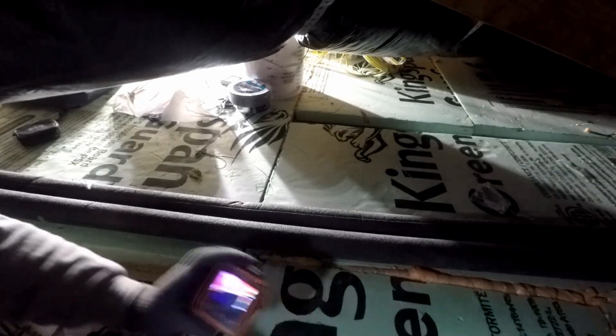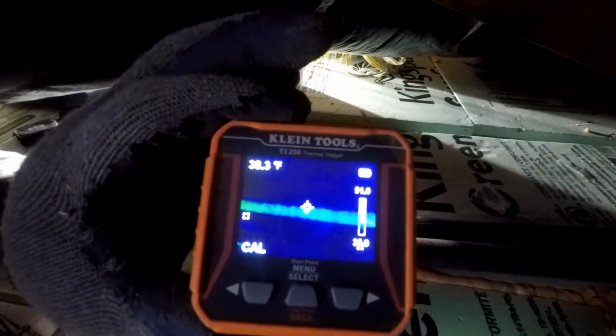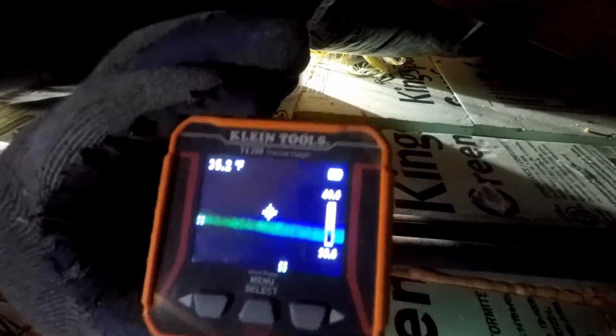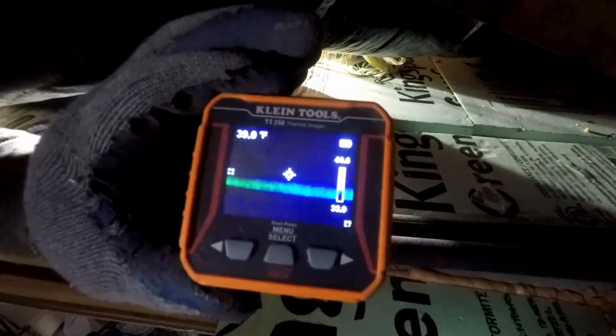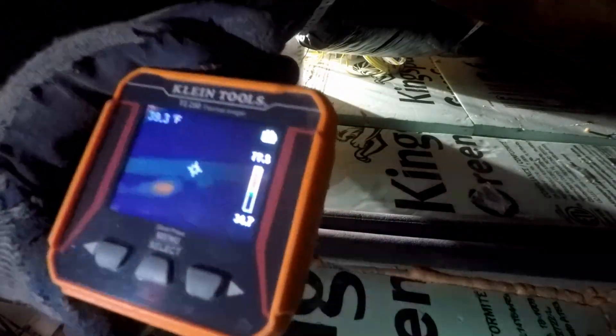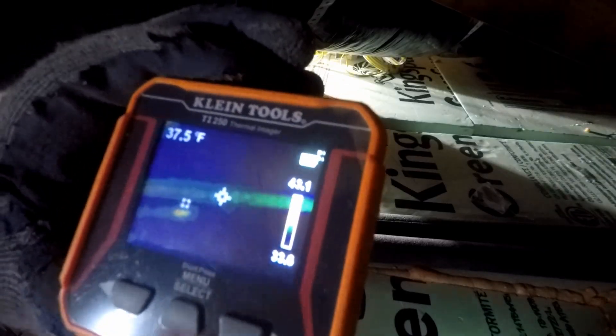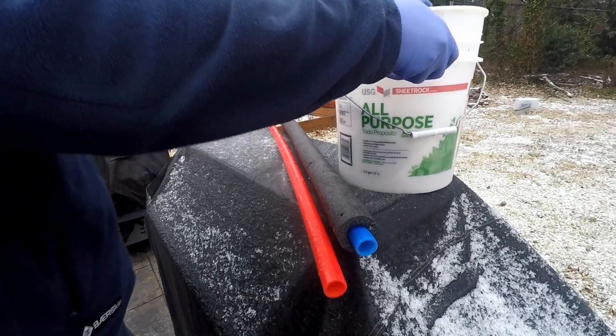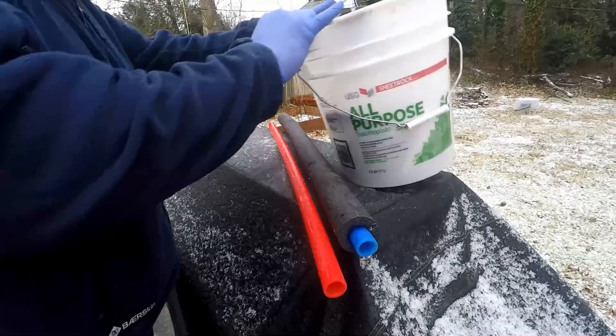There's work to be done before the actual solution is put in place. The architecture this time is to install an outlet near the water pipes. I ran an extension from the GFCI outlet used to test the heating cable. Before I begin, I'm looking at the pipes using a thermal imager. One pipe showed up clearly. Step outside to experience the cold showers the family will be facing — talk about motivation to get this done. This is the setup in the attic: there are two pipes and they are insulated, just as installed by the plumber.